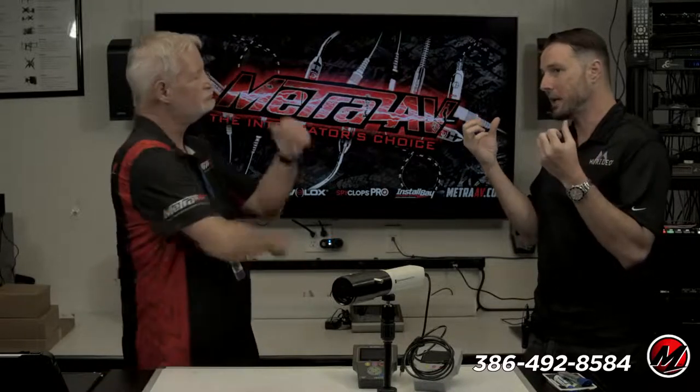So we're having these conversations about what's next, how could it possibly be better? We haven't even seen, and we can't even really imagine what could be better because it doesn't exist yet. There's only a handful of movies that have that super wide color gamut. And it's funny because in content creation, it's like, how can we make a movie at 10,000 nits with Rec 2020 color if we don't have a display that can show it? Well, the math is solid. We know the math is solid. When you convert, in a display, if you're showing 2020 content on a P3 capable display, the math is solid. We can squish that color gamut down. It's going to fit, it's all good.